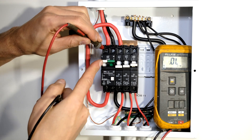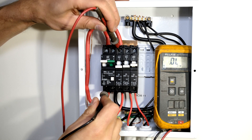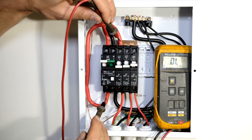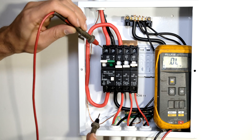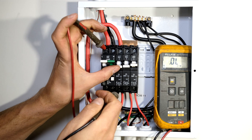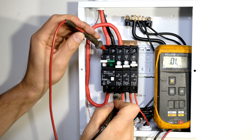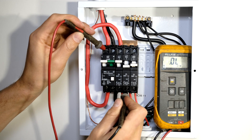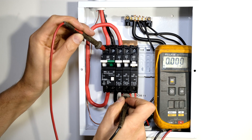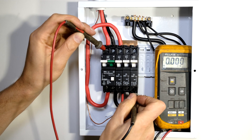From the input, when I close the circuit breaker you can see I have connectivity. Over here I have connectivity from that row because this wire goes all the way to the supply. If I want connectivity to my stove, which is my 30 amp, the stove circuit breaker needs to be closed - if I drop the stove circuit breaker you can see I'm disconnecting the stove. For the plug circuit you can see it is off, and if I close the circuit breaker there I have connectivity. For the lights - close the circuit breaker and there I have connectivity.